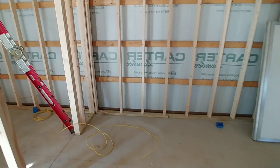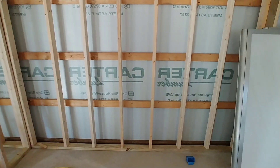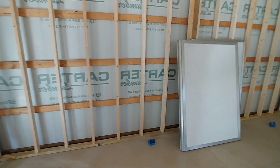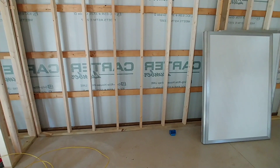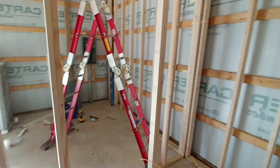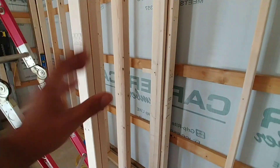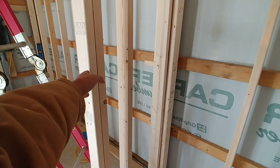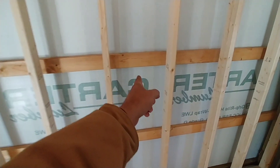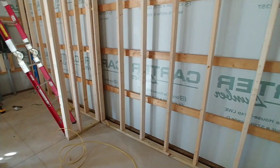The other big thing to keep in mind when installing outlets is locating them on your walls. I'm doing mine about 8 feet apart, which is well within code. What code requires, starting from a door opening, is that you have to be 6 feet from the start of it minimum, and then it's 12 feet between each outlet after that. So anywhere there's a beginning of a wall, the first outlet has to be 6 feet from that opening, and then 12 feet in between.